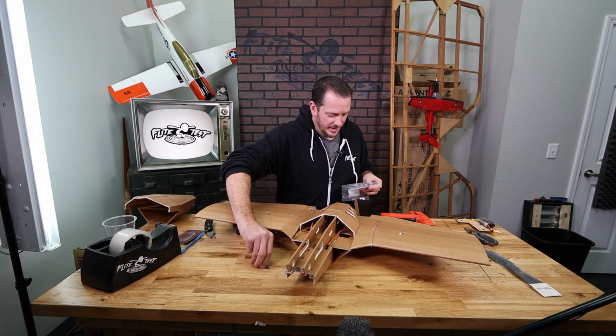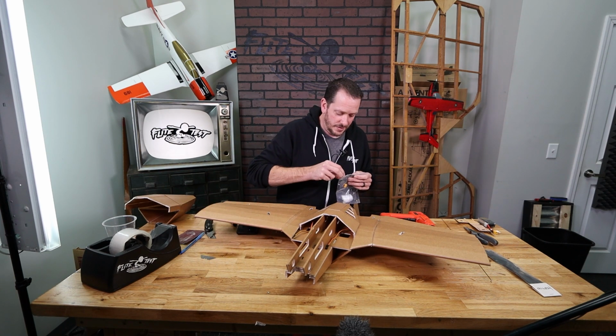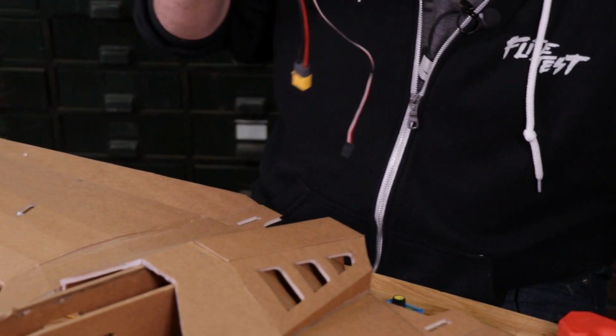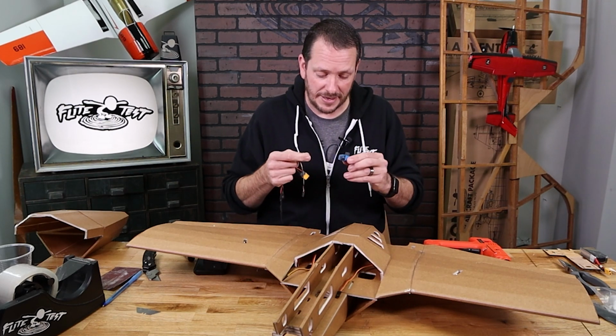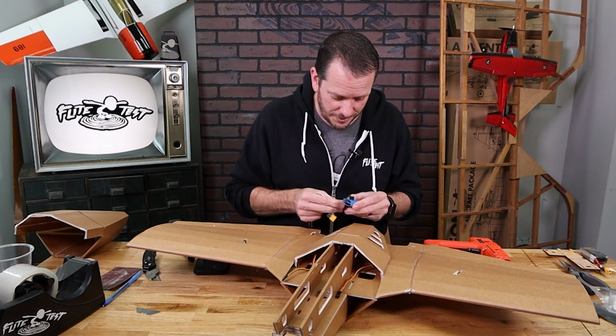For this, I'm just going to go ahead and take out my ESC. And this is frankly the safest way to power your servos because it's giving you direct voltage from your BEC, which is inside of this guy right here. If you accidentally put 2 cells into this, where you plug a 2-cell battery in, you will destroy your servos and possibly even your servo centering tool.